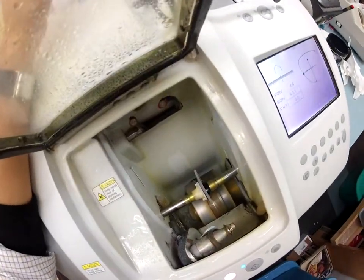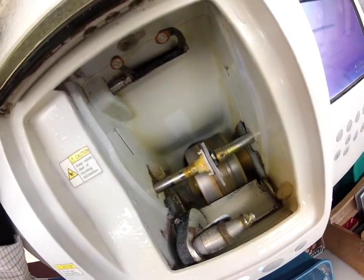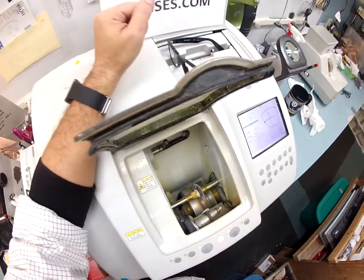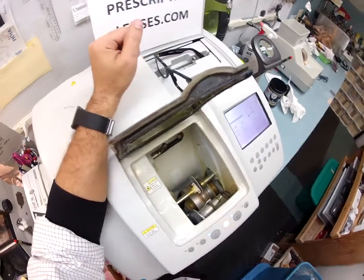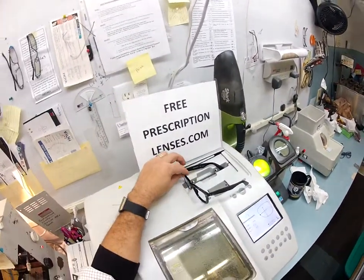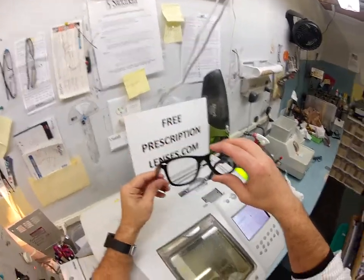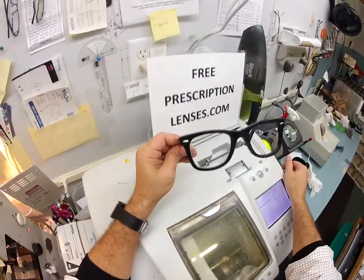As you can see, it's still completely flat — it's done cutting. Now it's going to put the bevel onto the lens so it stays inside the bevel of the frame. So, the other nice thing about these: we have the polycarbonate lenses which are thinner and lighter, unbreakable, bulletproof, UVA, UVB — you've all heard this before.